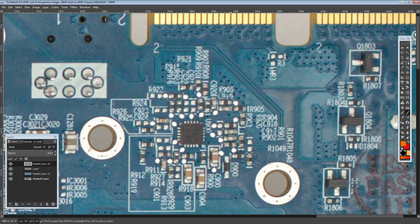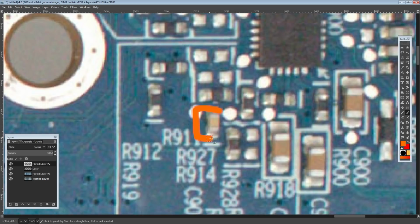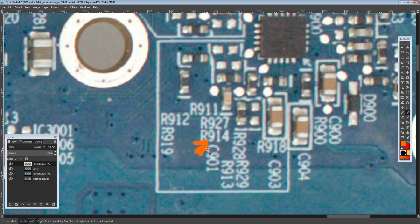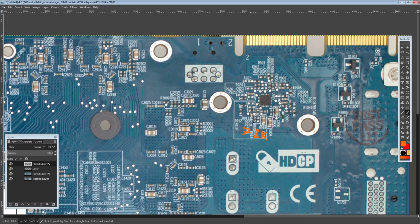And then we have capacitors over here, and then this one and this one up here. So there's way too many of them. But the thing is, I went around and checked the resistances on all of these capacitors, right across them. So you just stab one side and then the other side. And the only one that looked suspicious to me was this one. I can't remember what the other ones measured, but that one right there normally has a resistance of 7.8 kilo ohms across it. Okay? So that one's suspicious.